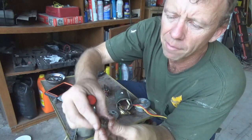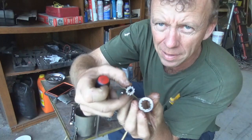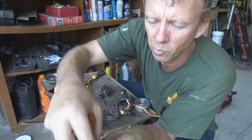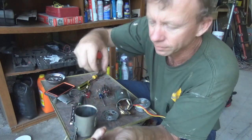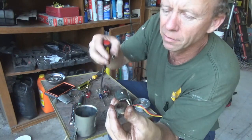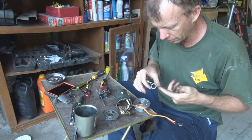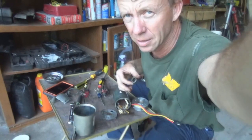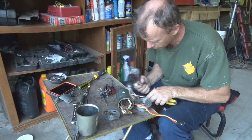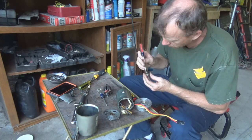I managed to get it loose. See that — now those are two separate pieces. This one turns inside that one, but it should be rotating around it like an offset gear. What I'm looking at is there's a bunch of gunk built up on these teeth, and that's keeping it from spinning. So I'm going to get my wire brush out, clean that up, clean the inside of this one, see if I can get those rotating. I put a grinding wire brush on my drill and worked the internal gear first, then took a screwdriver and scraped out the other one.